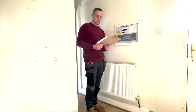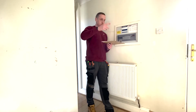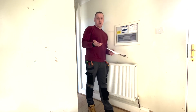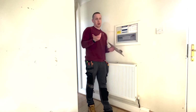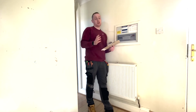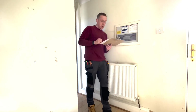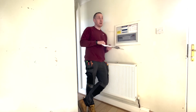Well, that's the test done. I've done the full set of tests, as you're supposed to. Done the long leads to make sure the bonding's in place. I've changed that for the 6 amp. I know technically you can take a 16 clip direct as well, in the wall conduits and that. But who knows if there's a bit of insulation somewhere, or 100 mil of insulation somewhere, and it's totally different. And it's a heating circuit, so it's probably not going to pull out anyway. But anyway, I changed it because I wanted a breaker. But yeah, that's everything.